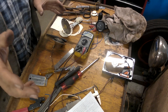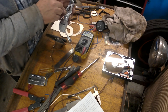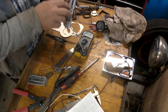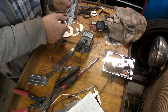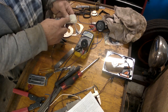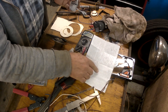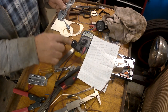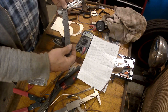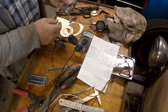My camera stopped for some reason. When the camera cut out I was just setting that dimension. Then I realized that when I received this, the wire was wrapped around there, so I undid it and wrapped it back and put a mark there so I could easily set it back to where it was. I then set that dimension to the other dimension from the table — five and one-eighths — using my trusty ruler. So that's set to five and one-eighth and I tightened up the screw.